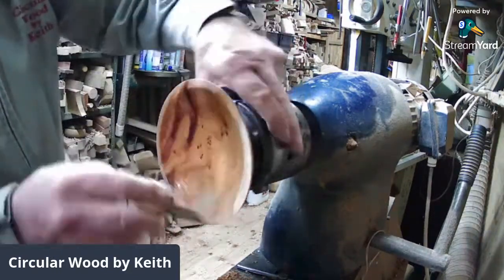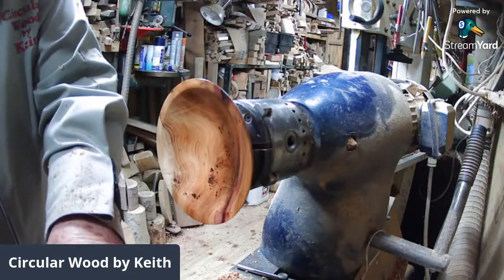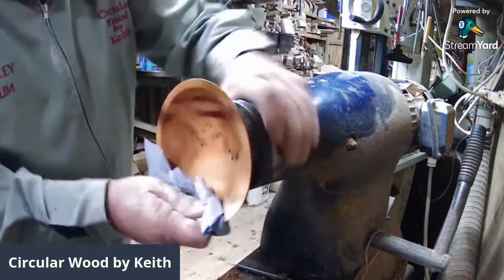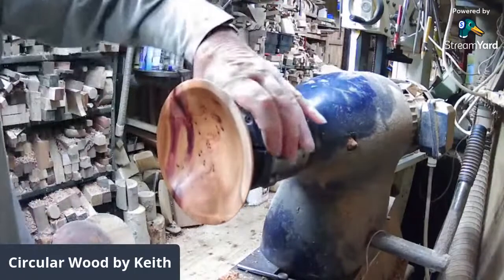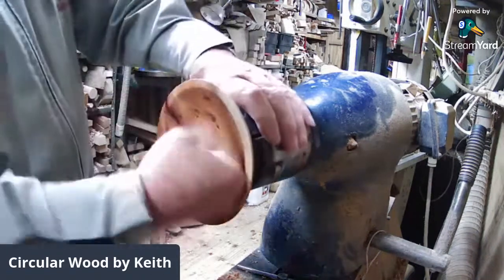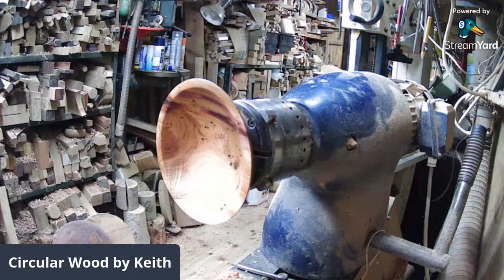So there it comes. I just want to keep the sanding sealer moving because, being shellac, this is thinned down almost 50-50 from the manufacturer's bottle with meths. So rather than wipe off the dust with meths, I'm wiping it off with the sanding sealer. You can see the purple quite well there. It's lovely. Just give that two or three minutes to flash off, and while that's doing that, I can kill the big sucky outy beastie. Don't need that anymore.